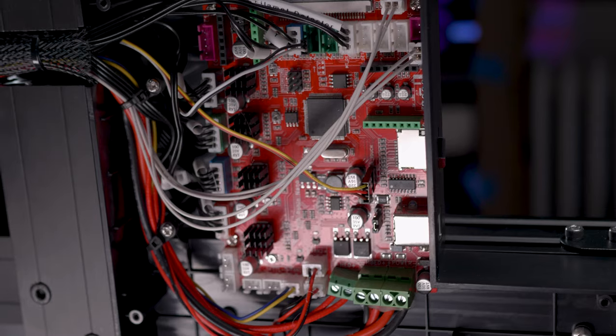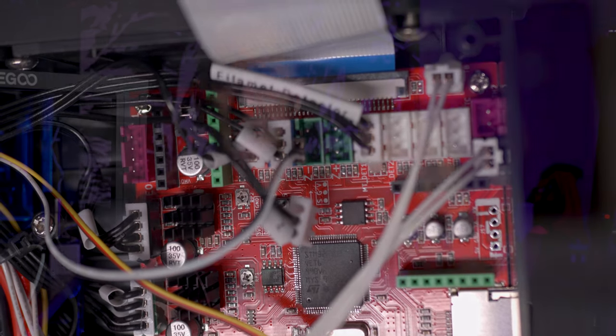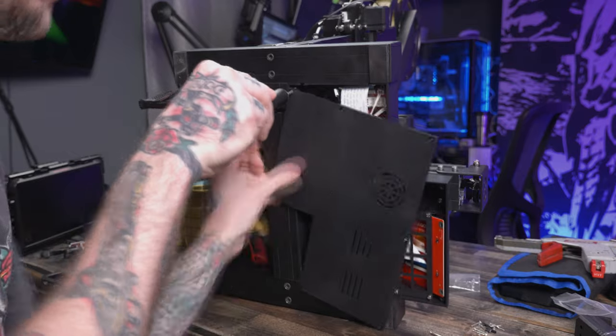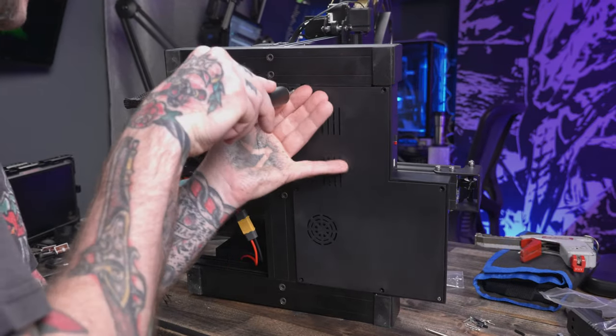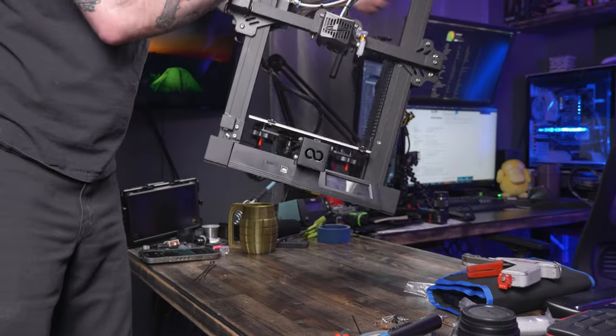Now there are three terminals in that connector — we want to be on the two that are closer to the inside of the board, closer to the processor. I put it with the white wire on the inboard and the black wire in the middle of the connection, and that worked well for me. This is a good point to note that I do have an accompanying blog post for this project on my website — you'll find a link in the description below where I have some photos and a write-up about this project, so if you need a reference while doing this you can refer to that blog post. After our wire connections are made, that's it inside the electronics case, so we can go ahead and put the cover back on — making sure to install the shortest screw in the very far front corner next to the LCD screen. If you don't put that there, you'll end up with a little divot on the outside of the electronics cover. Ask me how I know.